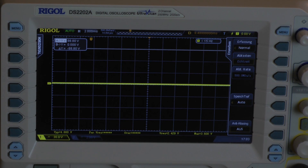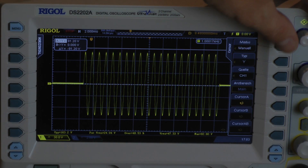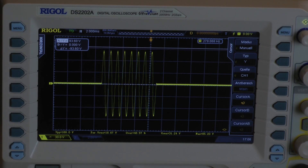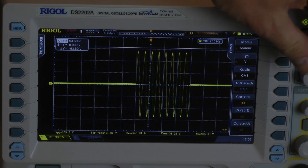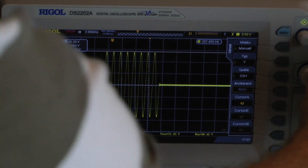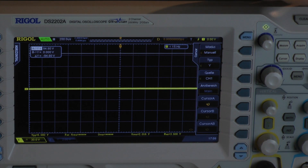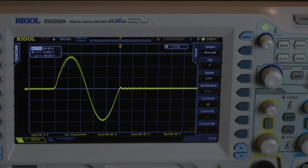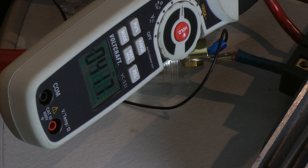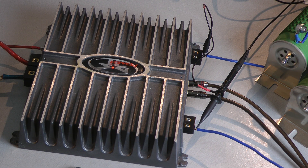Now I'm doing the dynamic power test with 20 cycles at a frequency of 1 kilohertz — it shows a maximum voltage of 82.8 volts, 219.8 watts. With 8 cycles: 85.2 volts, the amplifier delivers 232.7 watts. With just 1 cycle: a peak voltage of 88.8 volts, the amplifier delivers 252.8 watts for just one millisecond into a 4 ohm load, pulling 41.7 amps. Continuous efficiency is 70.9% and dynamic efficiency is 77.5%.